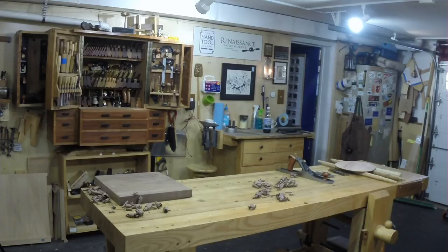The next thing here is you've got to have a blank for your seat. The seat pattern itself is running across the grain. So if you're looking at the front of the seat, it's running the same direction actually as the face grain of the plywood. That wasn't my intention, but in hindsight, I want to say that I did that on purpose because it helped me remember which way to orient the grain. So the grain's running this way. I'm setting the seat this way. So you can see I've got a fair amount of wood back here, and I want to leave that in place for now because this makes a great place to clamp stuff while I'm carving. I can bring two holdfasts back here and carve all in this front area.